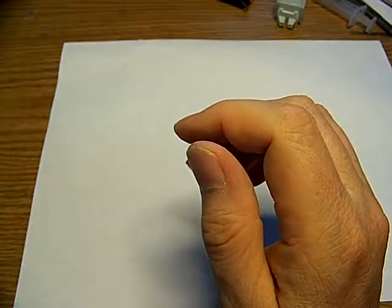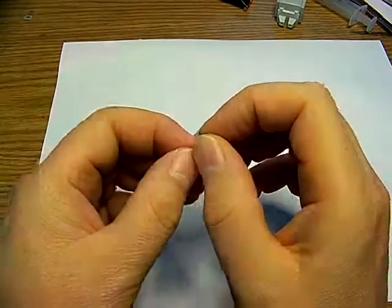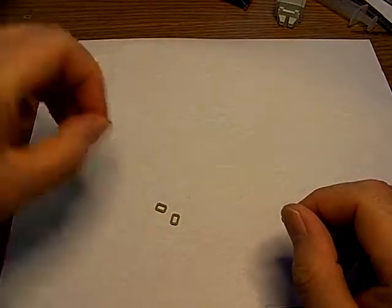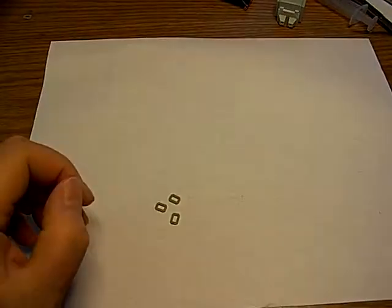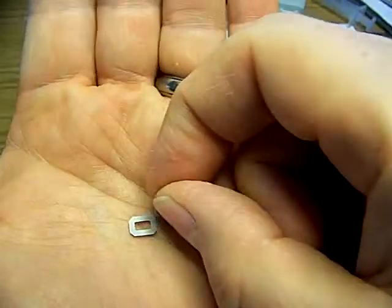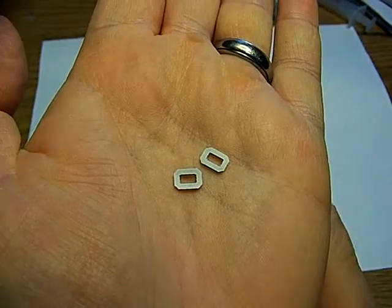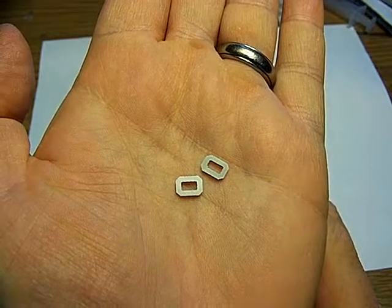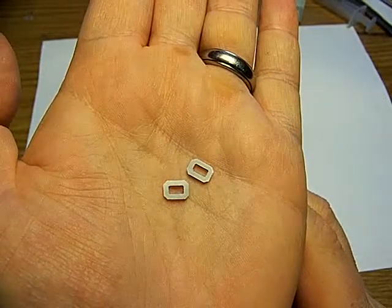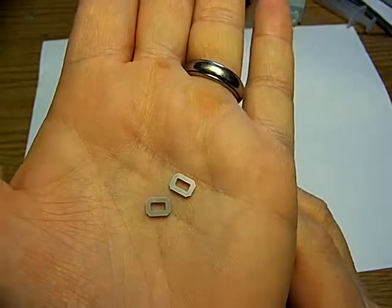I've been wanting to get back into Fusion 360 — the free CAD tool from Autodesk that's free to use for hobby projects — and use it with my 3D printer. Fusion 360 will print directly to my 3D printing software, so I can create a shape the same size as those rectangles in 3D and print them out. With my micrometer I measured those shapes on top of the battle cruiser landing bay, drew them in Fusion 360, 3D printed them, and here they are.